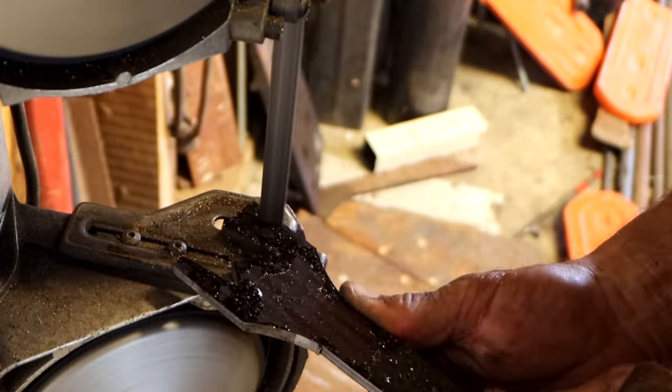I'm not sure it's coming across on camera, but all of the body panels on this machine have lots of dents and bends and things that could use my attention. That thing runs really well. But I did not leave this track that loose. Looks like I need to rebuild the track adjusters on both sides. This is the worst one of the bunch.